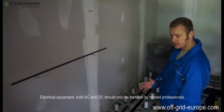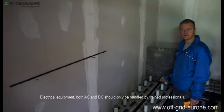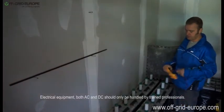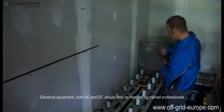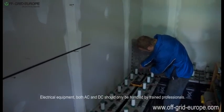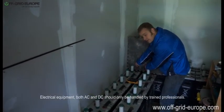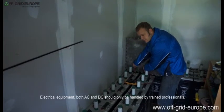It's been performing incredibly well. Right now it's at around a state of charge of 50 to 60%. A very simple way of just checking what the battery state of charge would be is to do a voltage reading across the positive and the negative at the end of this string. If I join this in here I can see I have a voltage around 50.5, which is giving me that indication of 50-60% state of charge.